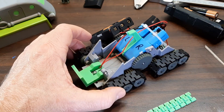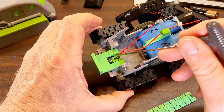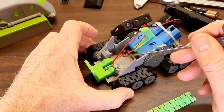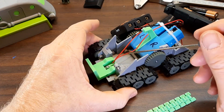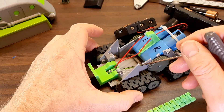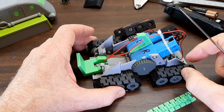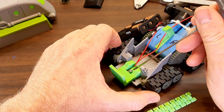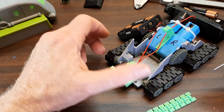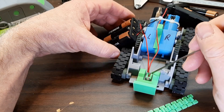The switch has a little clamp on it that holds it in place. It's the one I always use on my projects — just a very cheap little switch. I'll put a link on the site for which one to buy. It's called a sub-miniature or something like that. It has a spacing for a PC board — 0.1-inch centers for the terminals. That's generally what you look for when you buy it.